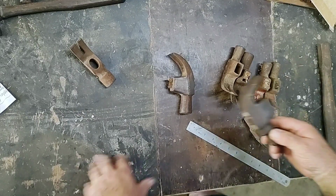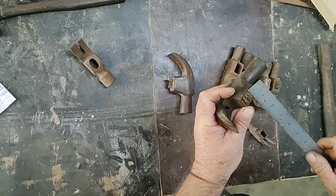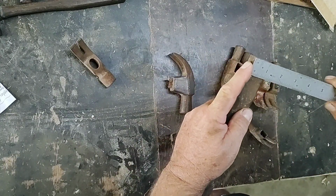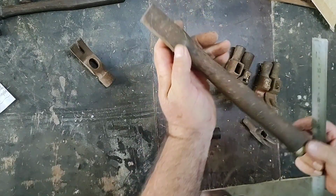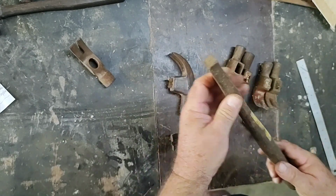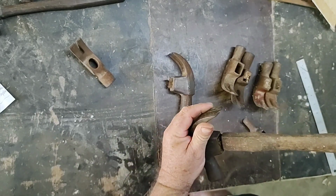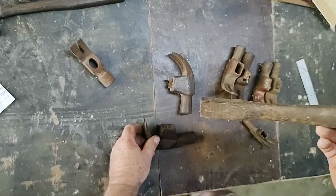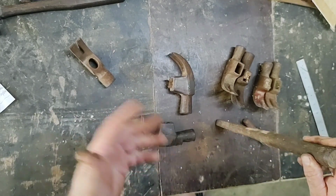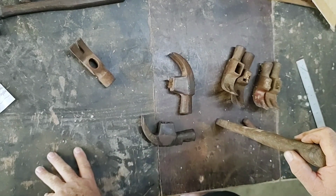So on, say, that'll be about a 20-ounce hammer head, sorry. That's an inch by about 5/8, which is a standard sort of handle, and this is a factory handle. This handle here is an inch by about 5/8. So all you'd have to do with this handle to fit was cut a wedge groove and pretty well drive it in, or just shape it a fraction and drive it in. Now on a normal hammer handle, you will have to do some sort of shaping, because your head might be a foreign made head or a weird shape or designed head, which you'll have to shape your handle a fraction for.